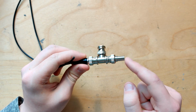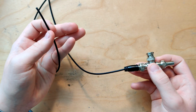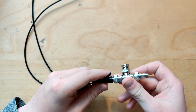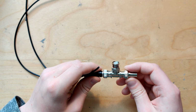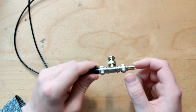You do want to have this 50 ohm termination resistor because this coax wire is literally just a coax wire. It does not have any termination built into it. A normal probe that you buy does. And if you use this without a termination resistor, you can have lots of issues like signal reflection, and picking up more interference. You do want this termination resistor.